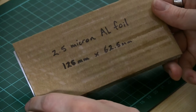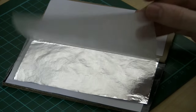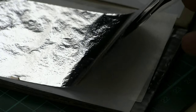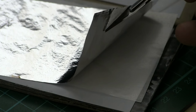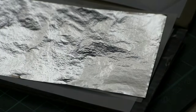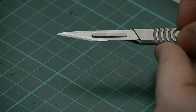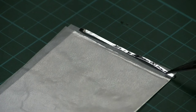This is what we're going to use to make our ribbon — it's 2.5 micron aluminium foil. A micron is one millionth of a metre, that's a thousandth of a millimetre. To bring it into context, the thinnest human hair is around 17 microns thick. So this stuff is exceptionally thin, delicate and very easy to tear, crumple and ruin entirely. Just cutting it is going to prove difficult. I'm using a fresh scalpel blade for the best sharpness I can get — anything more blunt than this and the foil will just tear.